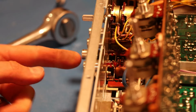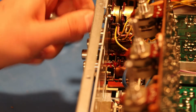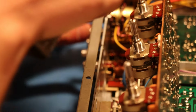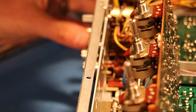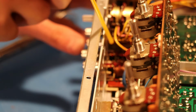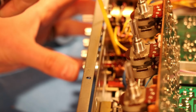You can see just below the volume knob are the push button switches. Really all you do with those, and I think we can use D5 there because that is metal on metal, is get that out. Here's our DeoxIT D5. And we'll just hit the switches. You just kind of get it on top. It has a way of spreading itself in there. It does pretty okay. There's a bit of an opening on it for the little spring lock thingy that actually makes it do the in and out type thing.